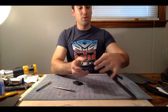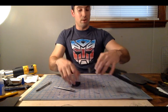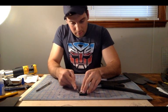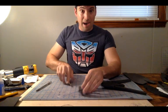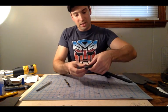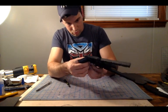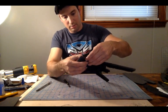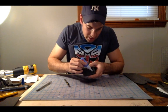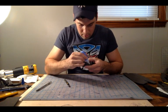There's our angle we want here. You'll notice right there we've got kind of a dip in the middle, so when I set this little box inside, I'm going to trim the box itself right there on the front edge so it fits better. There's another angle cut — pulling it back, doing about three or four passes. So we'll set it down and in there at the depth I want it — about an eighth of an inch down from the top. We'll just run some glue on the inside of it, hit all four edges, and then use a smoother piece to feed that glue into the seams — so it looks nice and smooth, going right along the edges.